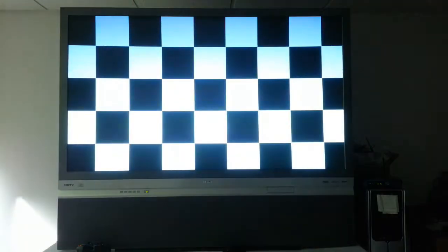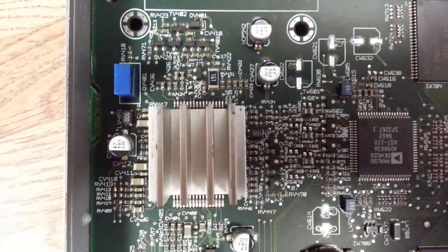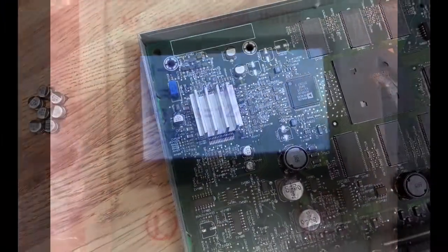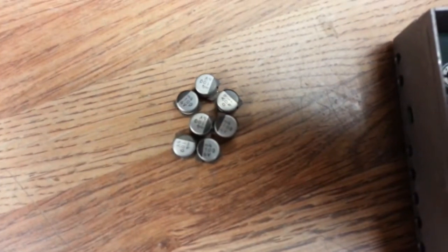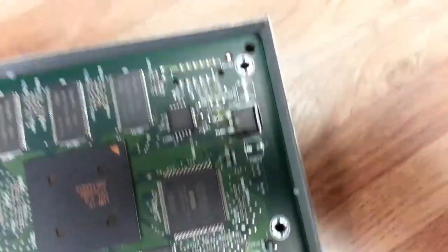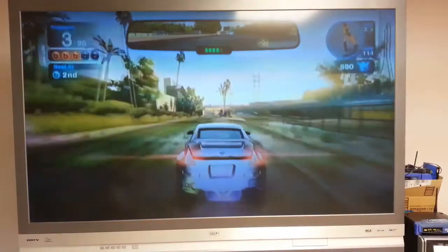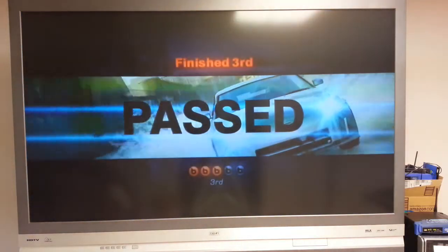This erroneously led me to believe that the formatter board was working properly and ultimately took me on a wild goose chase. All those patterns really proved was that the light engine was 100% functional and that the formatter board was also partly functional. What I failed to realize is that the formatter board is an analog to digital converter, and to process analog video adequately it requires very precise voltage management. As it turns out, the cause of the problem was bad capacitors on the formatter board — not the through-hole capacitors either, but tiny surface mount modules that were extremely difficult to replace, and this problem is almost completely undocumented on the internet. At any rate, replacing these capacitors solved the problem — it probably got rid of about 99% of the ghosting.